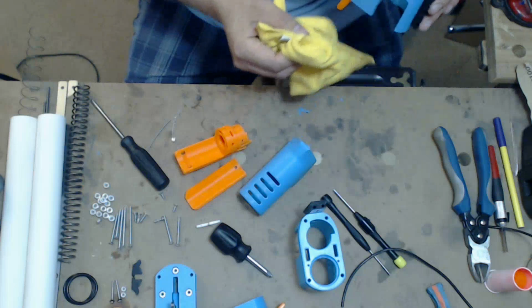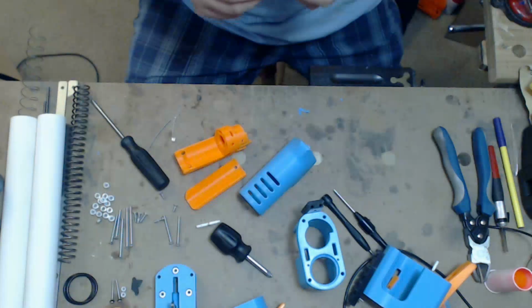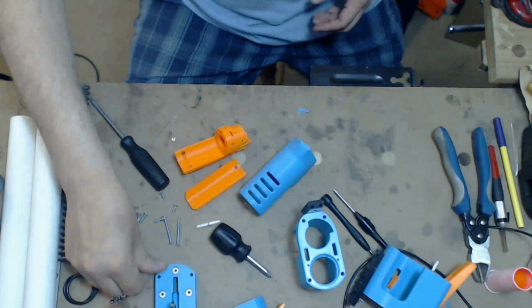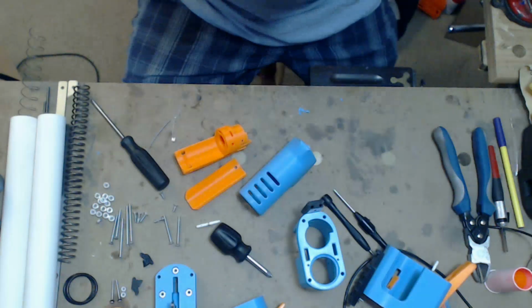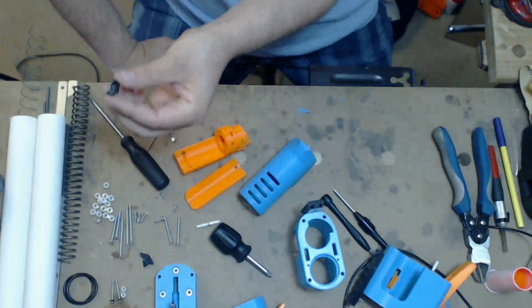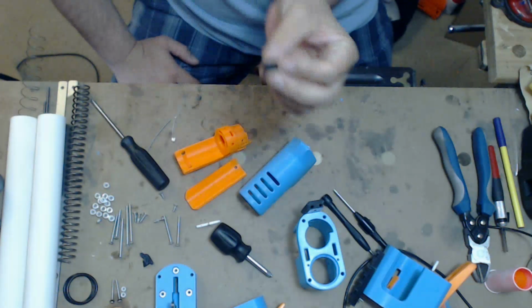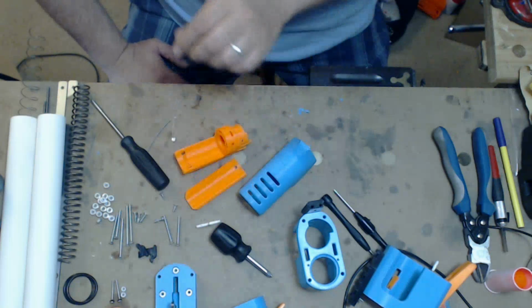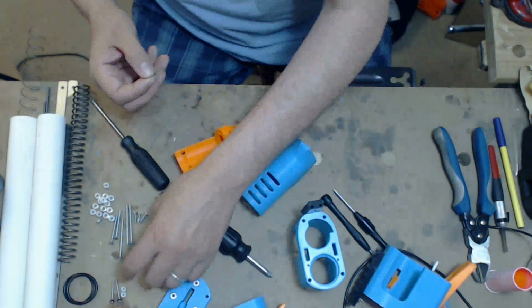I'm surprised there's not as much wear. What seems to take the most wear are the little locks. These are the things that allow the shell to eject out. Otherwise, they hold it in place until you prime it back, and then they kind of flip out, and the shell shoots past them. But one of them, especially this one, has really been eating away. So that's good to know. I probably could get away with using it for a little while longer the way it is.